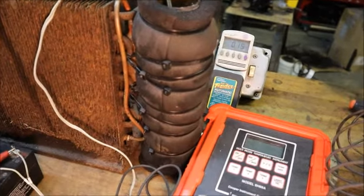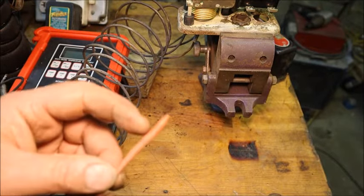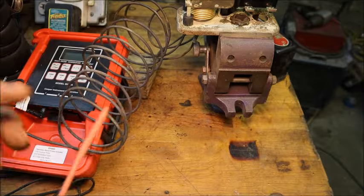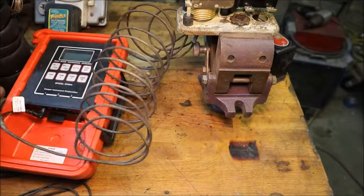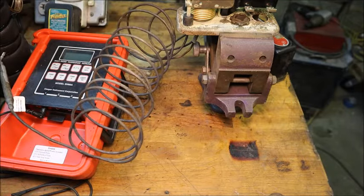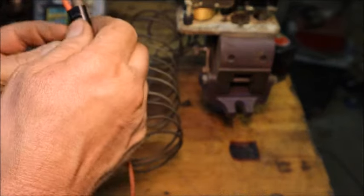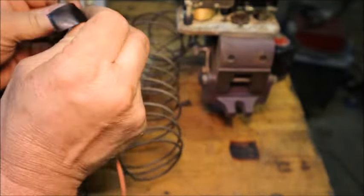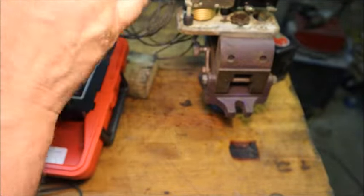For something that was almost free it works pretty darn good. The sensor for the thermometer is only active at one point where the thermistor is located, while this capillary bulb is active across its whole length, which does introduce error, especially if there's a gradient along the temperature well. I like to put the thermistor point kind of in the center and tape these together so they'll try to pick up the same temperature. This assembly will go down into the well on the machine.